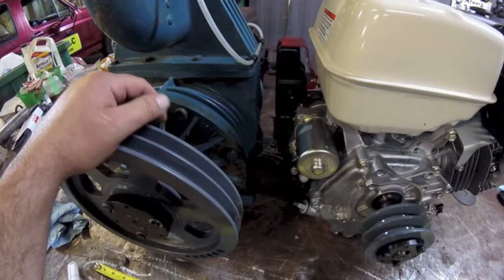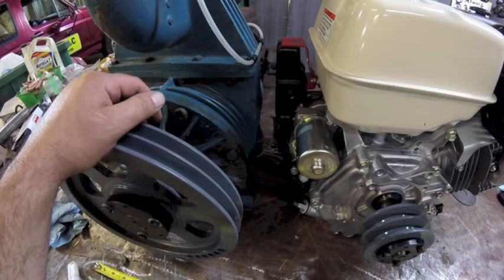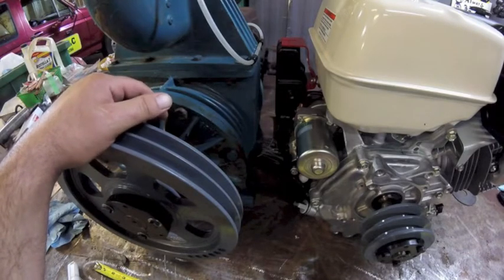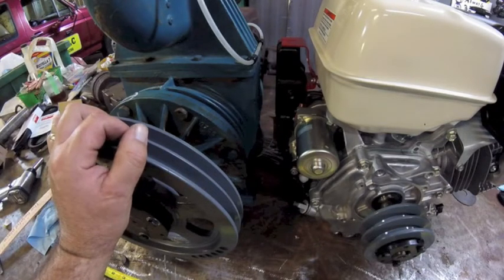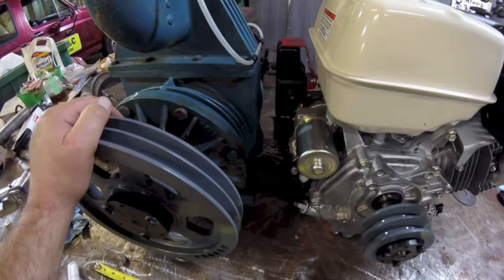For industry standards, you can get something with any length you really need. But off the shelf, it's going to be a B52. I like the ring of that one, so we'll go with that. I'll measure this up and see what belt we're going to have to use, and after I make sure that this is going to fit in the rough opening of that toolbox. Otherwise, I'm just going to have to make a box for it, and I'll just go back to the B57.